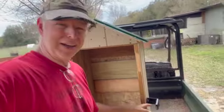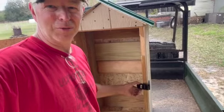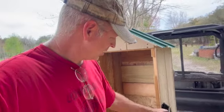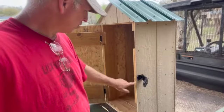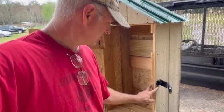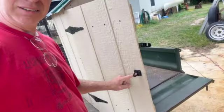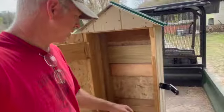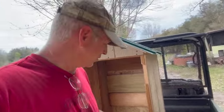The other thing that was weird is this hasp that I put on here to reach around and hook on. I don't really think it's supposed to be used that way. And the reason I say that is because the screws that are used to put in the body of the latch sink in quite deeply, right? The screws that are used to put in the hook mechanism, or the eyelet mechanism, line up perfectly with those screws, and if they are the ones that come with the package and they're nice and long, they're going to hit these screws. So clearly not meant to share the same space.